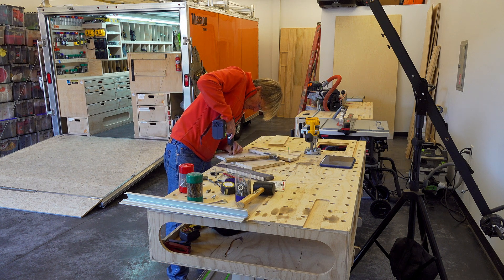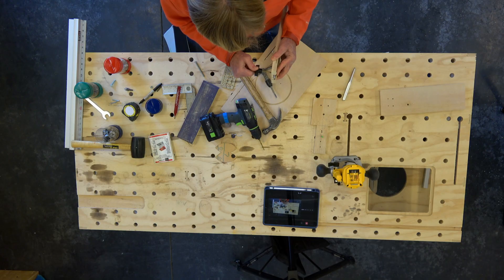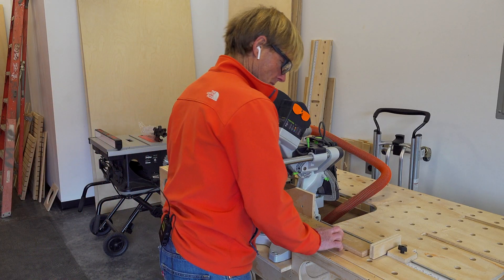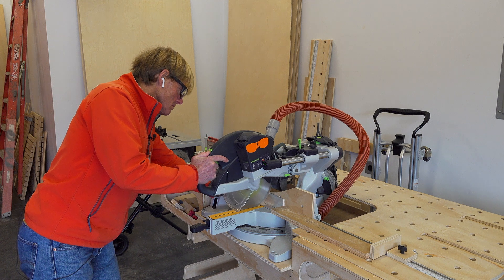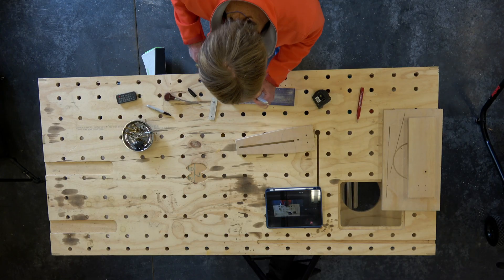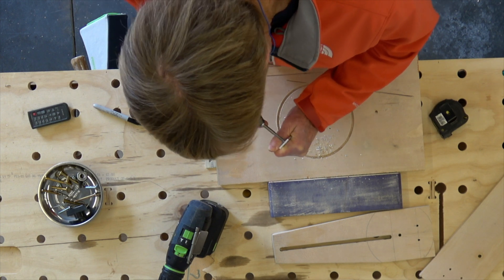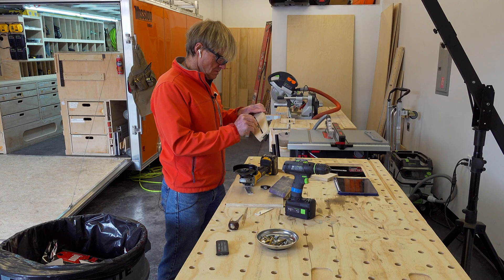Now I'm drilling the two holes and tapping them both — one for the pointer for the center of the circle and one for the bolt and nut to tighten it down. I used a wide bit when I drilled the holes through the aluminum and it's kind of soft so it wandered. I had enough material left so I made another piece, took a really small drill bit, punched the holes with the center punch, drilled through with the small bit, then went to the proper size bit and tapped a new one. The other one worked fine but was a little unsightly — it didn't affect accuracy, it just didn't look as good.